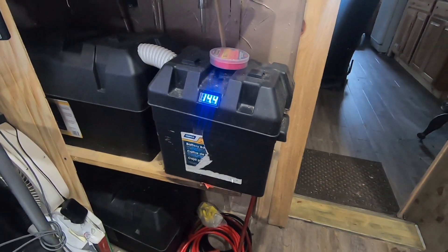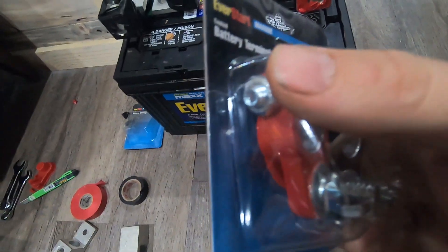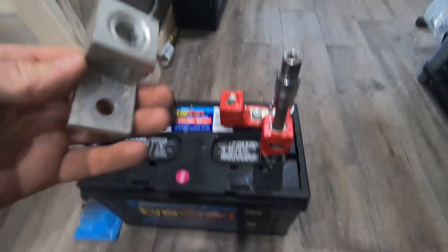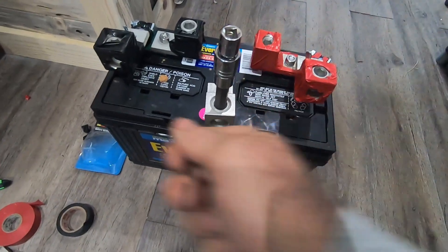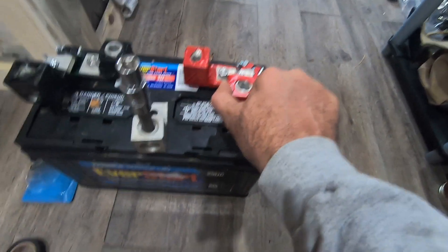Here's a little trick I do. I buy these color-coded terminals — color-coding is a must. They come with wing nuts, and you can also attach a lug that'll fit and just crank down on it. I don't like using crimp tools and I'm not going to spend money on one. These are rated for 500 MCM cable, they're aluminum but rated for copper. I've got an allen key that fits right into it and I can crank down. Coming in, coming out, I can put two cables to this.